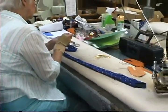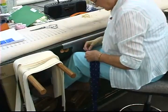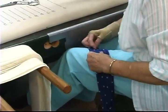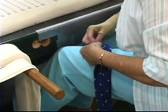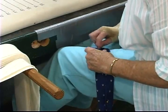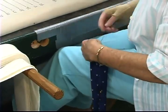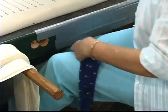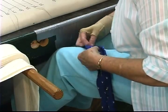There are approximately 100 hand stitches in the length of a tie. The hand slip stitch is the lifeline of the tie. This process allows the tie to have flexibility — to move and to relax after being worn all day, knotted and unknotted. The quality of the fabric and the quality of the inner lining in this process really make a difference in the way a handmade tie drapes and the way that it returns to shape after being worn all day.